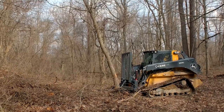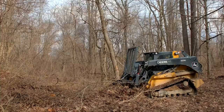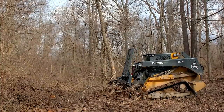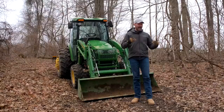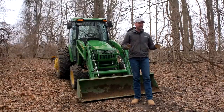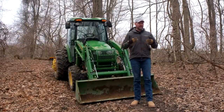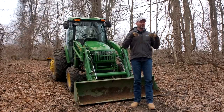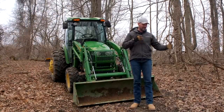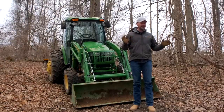We're gonna use a tractor here, get the landscape rake. I wanna try to reclaim, I guess, this topsoil. So we're gonna peel this off before we put down our roadbed. And so what I wanna do before that is get the leaves, the sticks, everything else off the top of it to make it cleaner so that when I wanna go and repurpose it somewhere else, I have just a cleaner infill that I can use and have it ready to go versus having to try to screen out or scrape out or rake out all the sticks and the leaves and everything else in there.